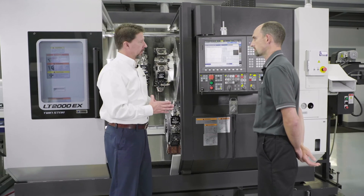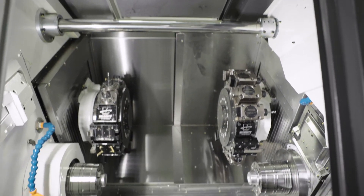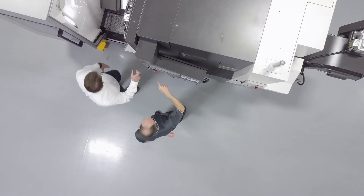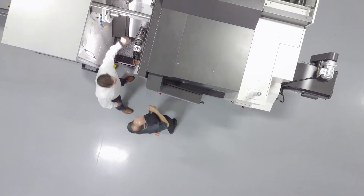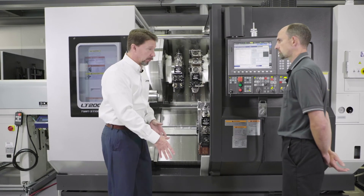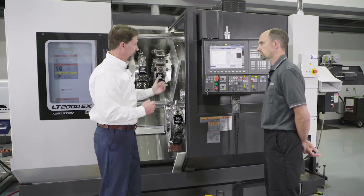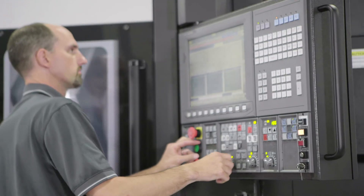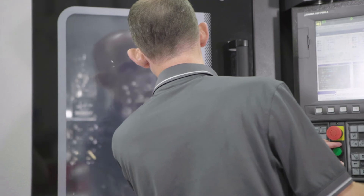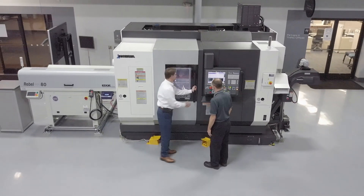Just to recap: LT means it's a twin spindle machine — not a sub spindle, but actually matching horsepowers left and right. We have the opportunity for twin turrets or triple turrets, and it's very automation friendly — we can set it up with an edge bar feeder or any bar feeder, a part unloader, and we can also very easily automate from a robotic standpoint with a pedestal-mounted robot, a robot on a rail coming through the front door, or pedestals in the back with robots reaching over the front. The operator still has full access to the front of the machine to change inserts and access the control. It's made for high-volume production. Will, thank you for your time today, and thank you for joining us on this virtual tour of the Okuma LT Series.